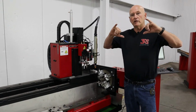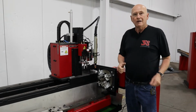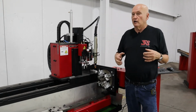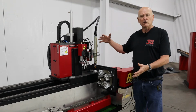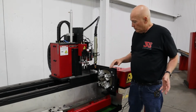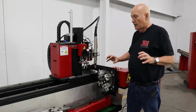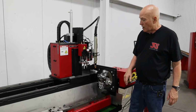and that is that it's a fairly weak structure, because the little spur gears that are holding the independent or the opposing rollers aren't any bigger than your thumb. So you're very limited in how much weight you can put on them. You just shear the teeth right off them. And the other thing is, it was very, very large, so we didn't want to do that. We wanted something that had very low rotational inertia so that we could spin it easily with small tubing. And we came up with this design right here.